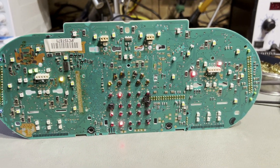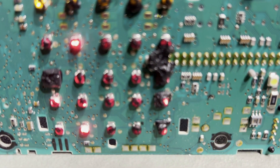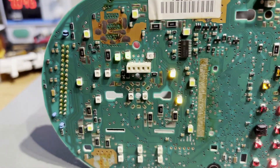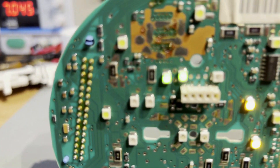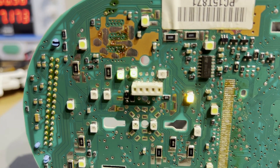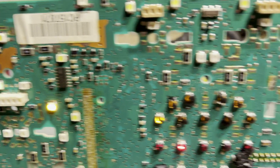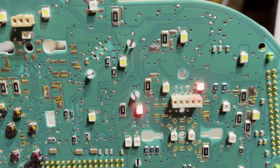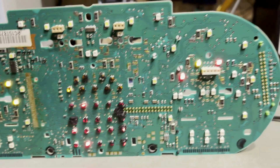With the display removed, you can actually see that most of those LEDs are actually working — just covered in silicone. The others aren't, and the backlight's not working either. Even though the green LEDs on there indicate that the side lights are on, which they should be because that's how I've set the test rig up. And none of the gauge illuminations are working. So we're making progress, but still some faults to find.